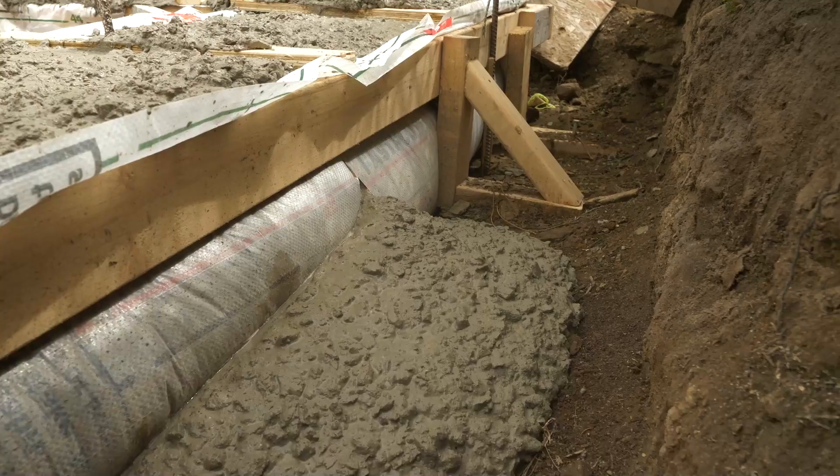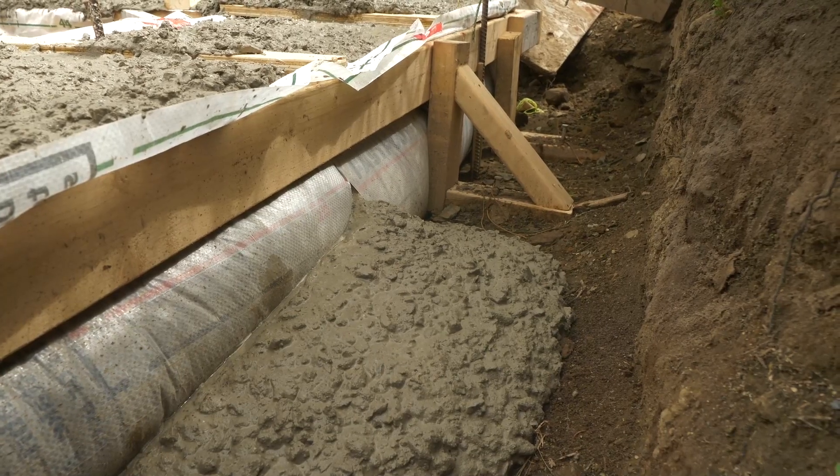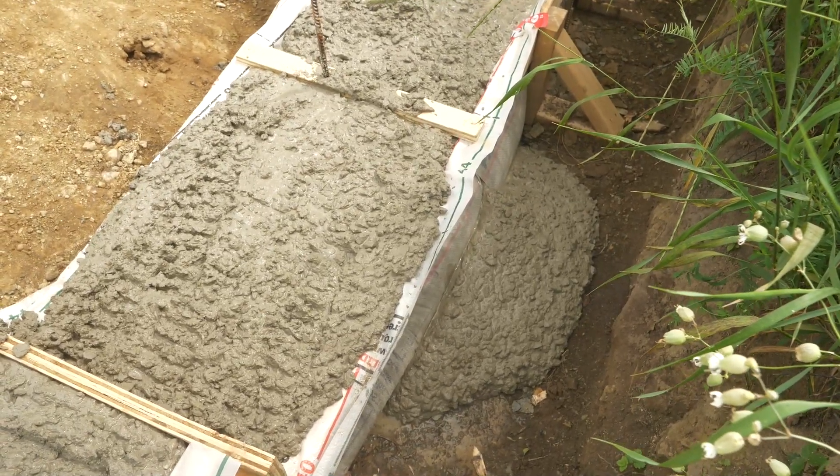Overall the pour went really well today. We had one little leak where we had a lap in the material, so it wasn't a blowout or anything — I'm very happy with how everything went. Some of the benefits: it is quicker to work with, especially on an uneven surface like we had here. It also uses a lot less material, which means a lot less to strip once the concrete has set. The bag holds in moisture too, so if you're working in a very hot climate the concrete will cure a lot better. And lastly, moisture won't wick up into the footing, which can be an issue in some cases.